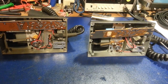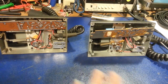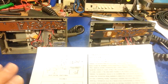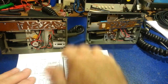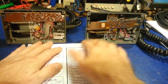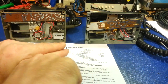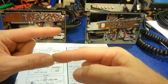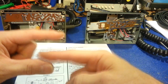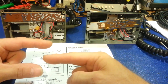That switch says right there: electronic or relay switching. I covered that recently in a video, and since I have these on the bench torn apart now it's a good time to cover exactly what that entails electronically inside a microphone. In electronic switching, your switch has two contacts and a center pin that can contact either one depending on whether the push-to-talk button is pressed. In electronic switching, that center pin is also attached to your ground or the shield wire.